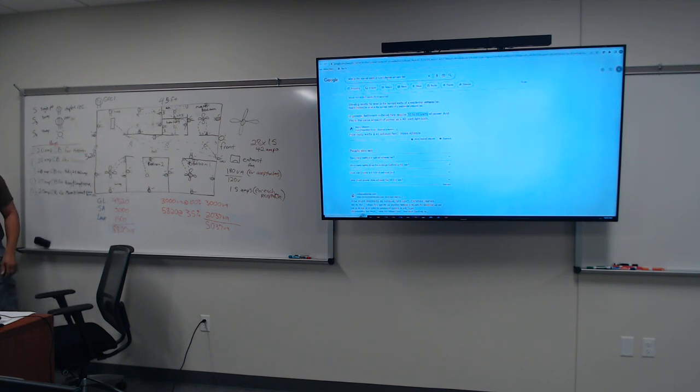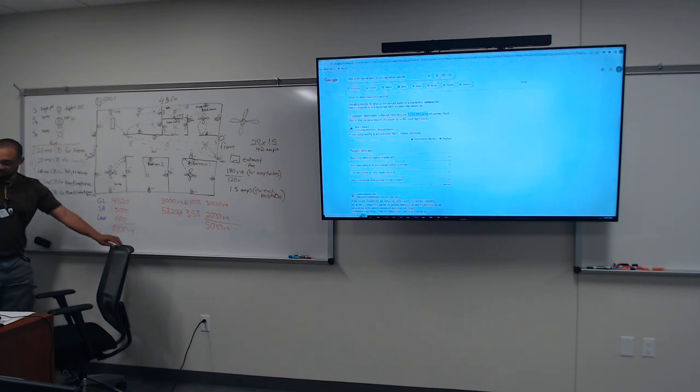Yes, sir. All right, so y'all want to use 40? Between 30 and 50, let's use 40, right? So the exhaust fan is, let's say, 40 watts. 40 watts divided by 120 is? 0.33, maybe. I know it's small. You said it was 40 divided by 120? Yeah. 0.333333. You're right. All right, so our exhaust fan, let me put that on the board.